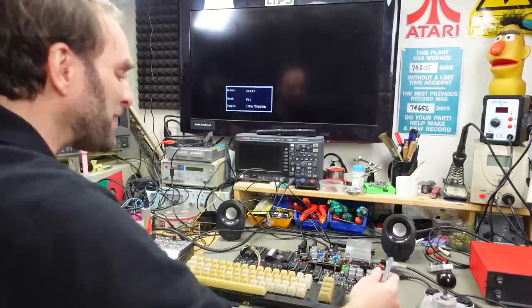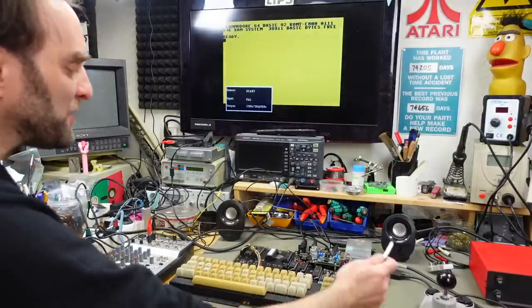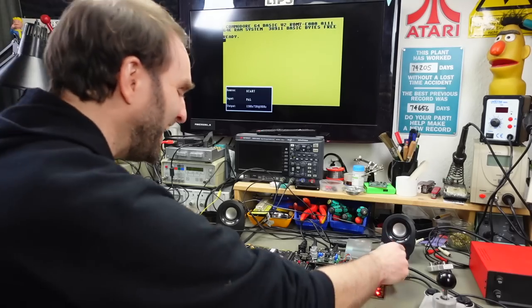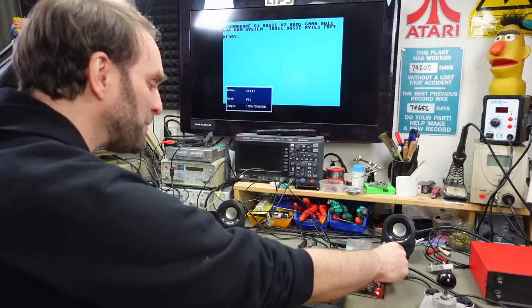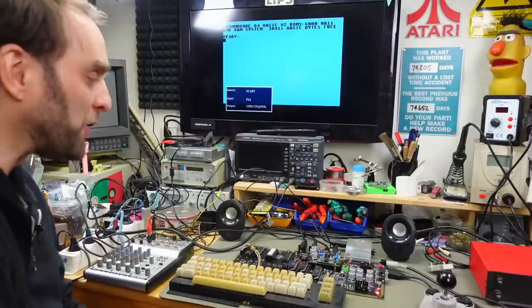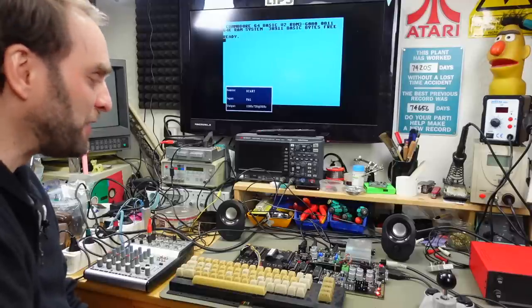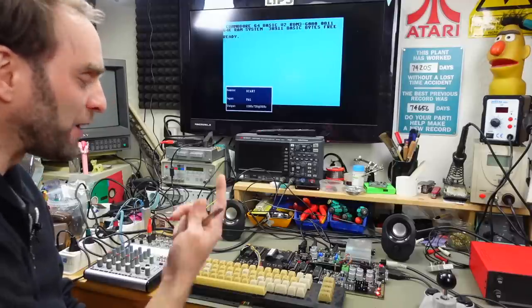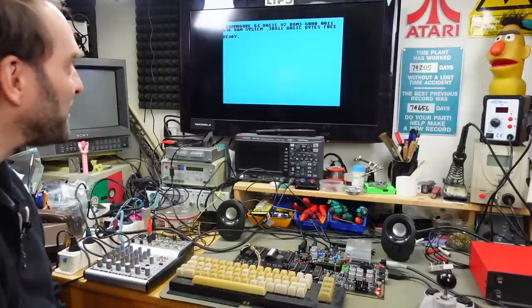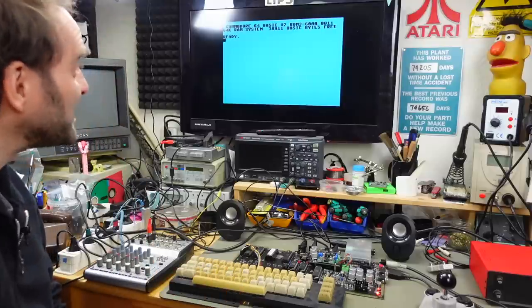This is just example stuff they put on the pre-programmed EEPROM, obviously, with different colors so you can see the different ROMs being accessed. This is ROM 7. You can just use the dip switches on this one to switch between different versions. You can, of course, put like JiffyDOS or Dolphin DOS or, I don't know, you name it. Any kernel ROM that's available for the C64 should work absolutely no problems with this, because it's just accessed in the way that the original ROMs are accessed, and the C64 doesn't know the difference.